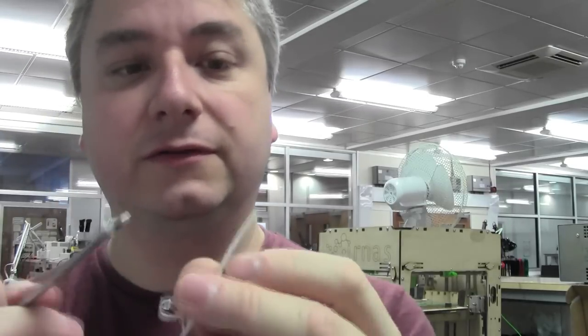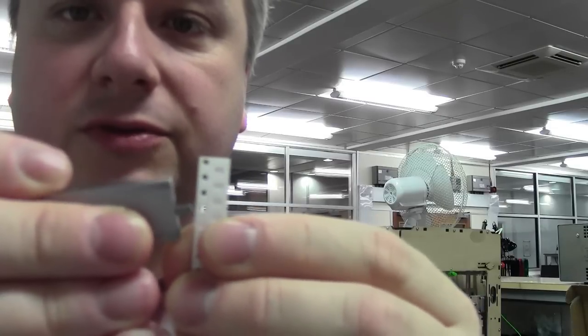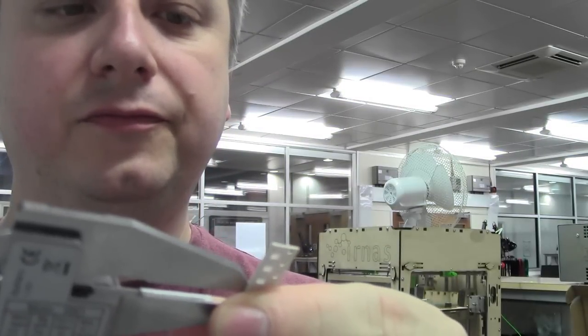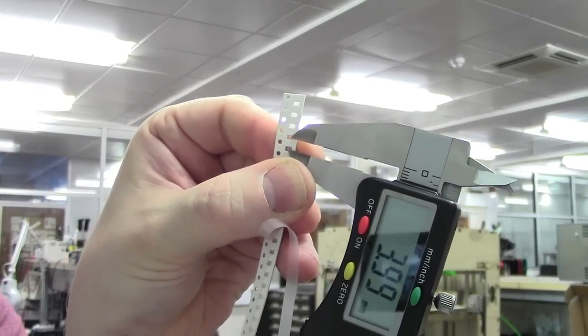So the easiest way is to measure from the bottom of one carrier. So go from the bottom edge down here to the bottom edge of the next one, which will be, in this case, again 4mm. You can see that from the bottom to the bottom, about 4mm. So we need to use a 4mm feed rate. Now when you're programming feed rate, you have to program that into the actual lane itself, into the feeder tray where all your reels are installed.